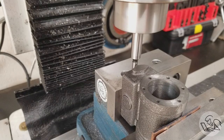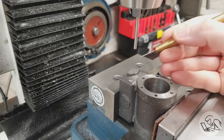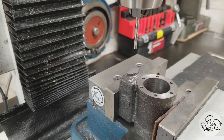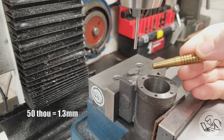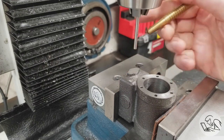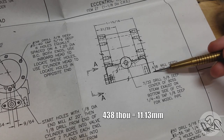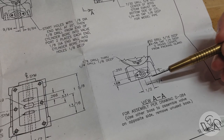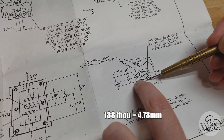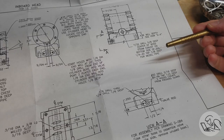Next, the hole for the valve rod, which is referenced from the bottom edge of the steam chest — so I'm edge finding there. Here's a really interesting problem I've just encountered: using the DRO to locate the center of the boss for the valve rod — look at that, it's not even close. That's off by about 50 thou. Something is clearly wrong. This hole is located from the bottom surface of the steam chest and that all checked out. The drawing shows a mill depth on the steam chest of 438, and I double-checked — I'm within a thousandth on that depth. So what's going on?